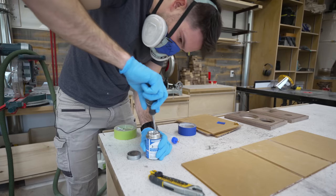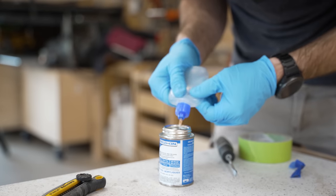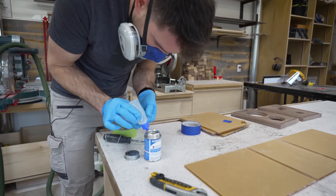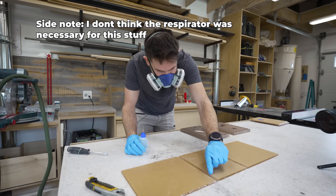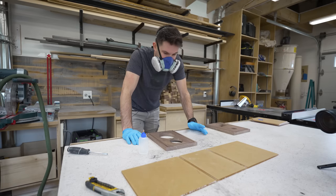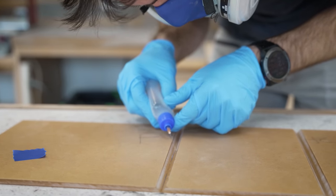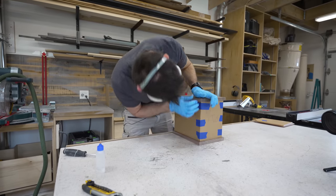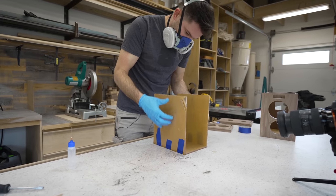With the prep work done, it was time to crack the code of how to open the Weldon bottle and then suck some up. To give the Weldon the best possible chance of adhering, I thoroughly cleaned off all of the seams. Apparently clean and smooth is the name of the game with Weldon. My plan is to apply a quick bead along this edge, fold it on itself, and then slot it into the front panel. The part that nobody prepared me for is that Weldon is actually thinner than water, so getting it to stay just inside the miter was basically impossible. And to make matters worse, if you get it on the frosted side of the acrylic it'll remove the frosted texture. Lucky for me, I had the frosted side facing up, so at least gravity was working in my favor.